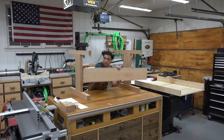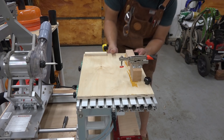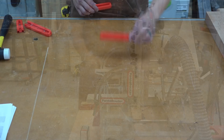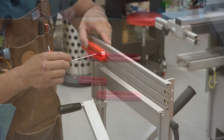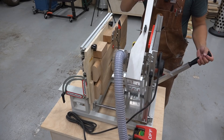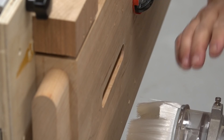I know it looks really chunky right now, but I won't be able to start shaping these pieces until I finally attach the stretcher. The stretcher will be joined to the leg assembly with a 1-inch thick by 5-inch long through mortise and tenon. I used a shop-made fixture to hold the leg post to the machine, tilting the table to the vertical position. To make the custom 5-inch long tenon template, I cut the rounded end of a 2-inch and 3-inch tenon template and combined them on the template holder — a method Max Sheldon from Pantorouter experimented with. And as you can see, a clean, seamless, 5-inch long mortise.